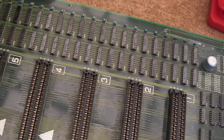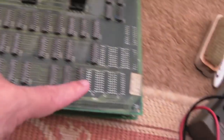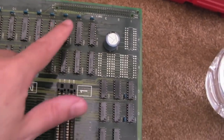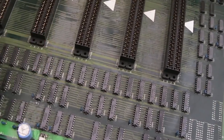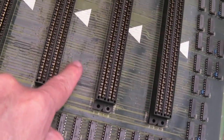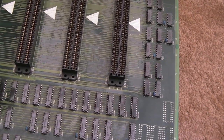This top board has had a very thorough clean. You get these weird marks on here that just won't come off — it's not dirt. I've cleaned the tops of the chips and around the key areas, gone over the top of the connectors, done the underneath as well. All the chips are cleaned but there are still bits of dirt around. It's super time consuming — I've spent the best part of two hours cleaning that up. I can only imagine it's because it's been stored in a damp location for a period of time — something started to actually eat away at the solder mask.